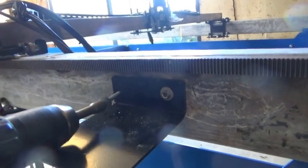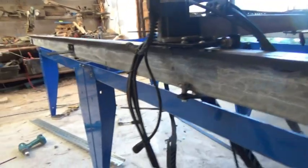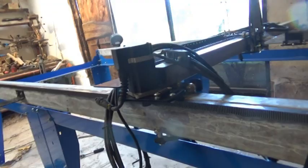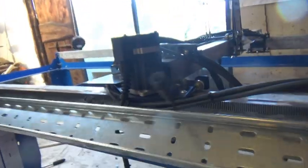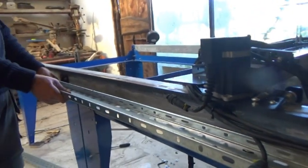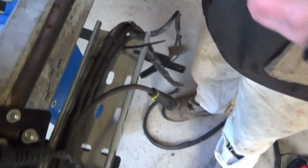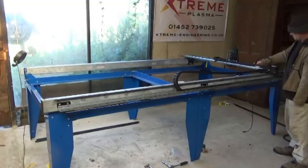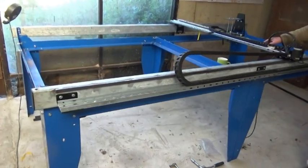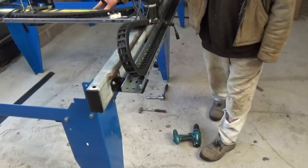This one needs adjusting. We'll skip that bit. These are for holding up the drag chains. Now I realise that we have put them in the wrong place — it is too high, but it's no trouble to move them down a bit. There's a lot of wiring on this machine, and most of it has to move around the table as the head moves around, but it mustn't snag on anything. So drag chains are used to keep the cables neat and tidy as they are taken up and rolled out.